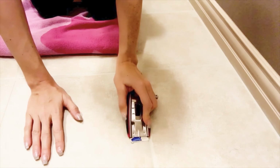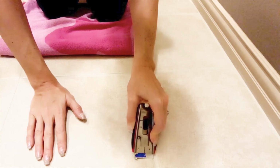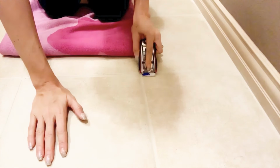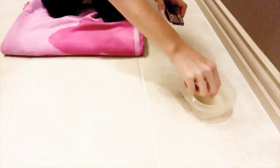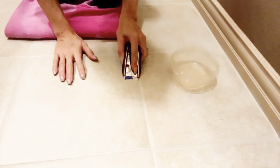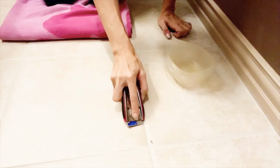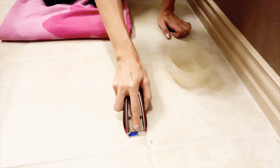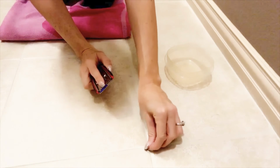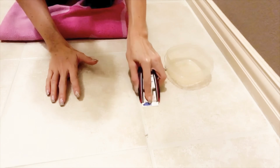If you can kind of see, like there's a little edge of the grout here. So I'm gonna just take a little razor blade and run it along the edge there. And then put the extra here. And my tile is pretty much the same color, so even if there's a hair bit on there, it's fine. But if you're doing a totally different grout color, then you'll want to make sure you get a little bit closer in to the edge. But that's all you do really. And even if you give it a few more hours, it'll still clean up real easily.